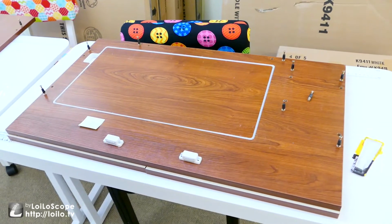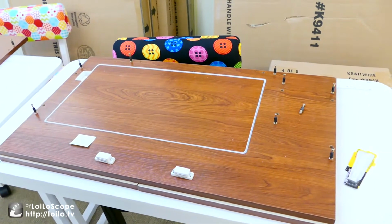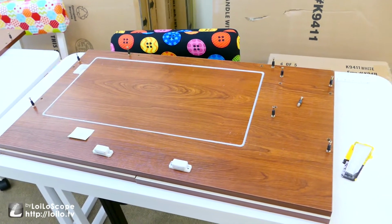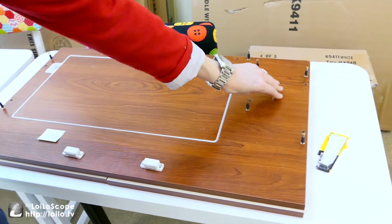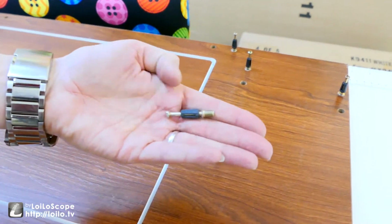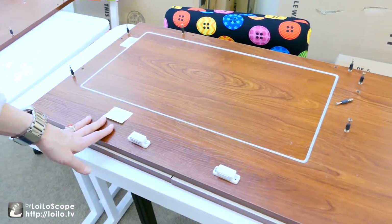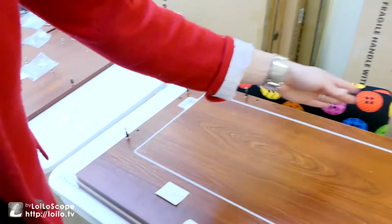In step 1, part 1, you want to gather up your A panel, your V1, your V2, your X and your Z, as well as your bags full of your C1 cams. And they look like this. They're the gold with the black plastic tip on them. And you're going to insert them into panel A. There are 8 of them, so you'll notice placement here.